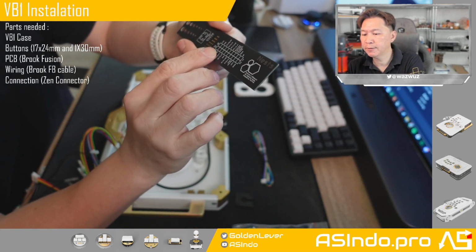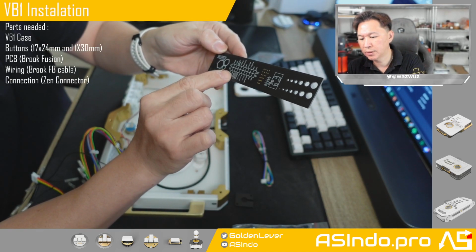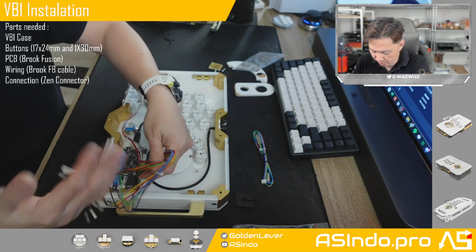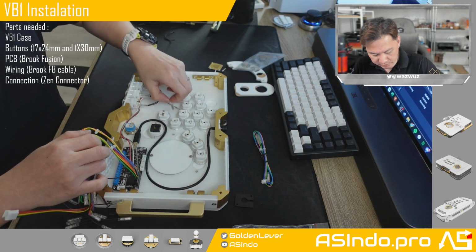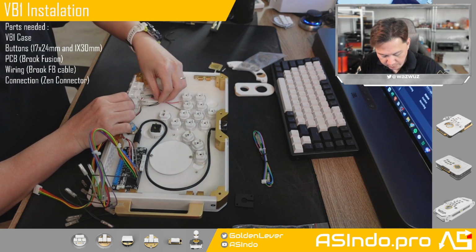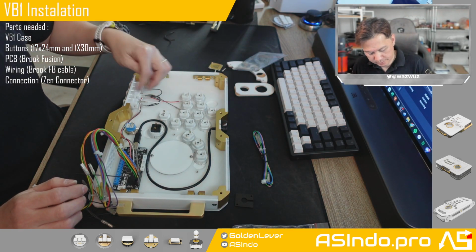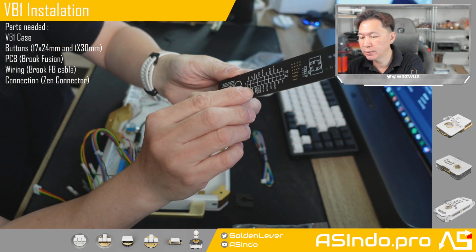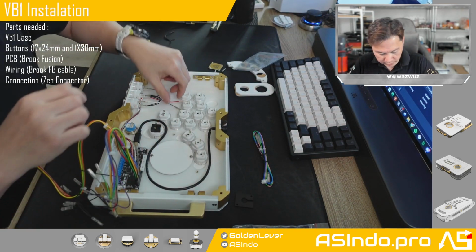If you see like this, pin number 1 is on the left, so like this orientation. Start is actually 1, 2, 3, 4 on the bottom row. 1, 2, 3, 4. It's white. White will be start. And the middle one, I want to be share. If we see this, 1, 2, 3. Share or select is the third, which is red.